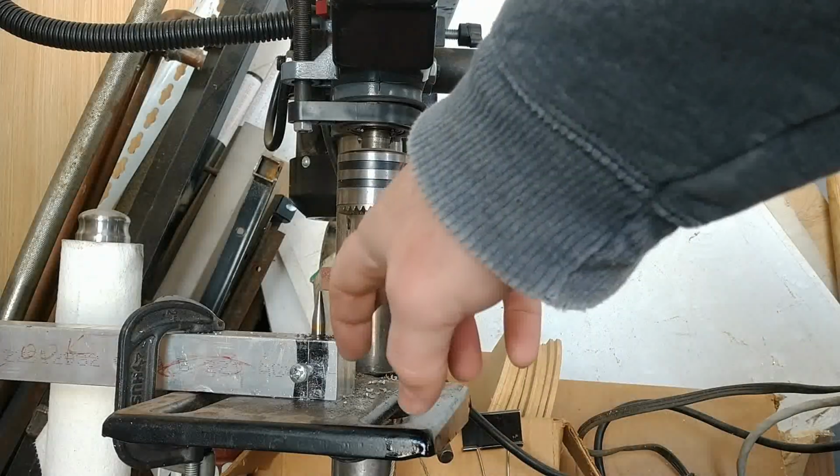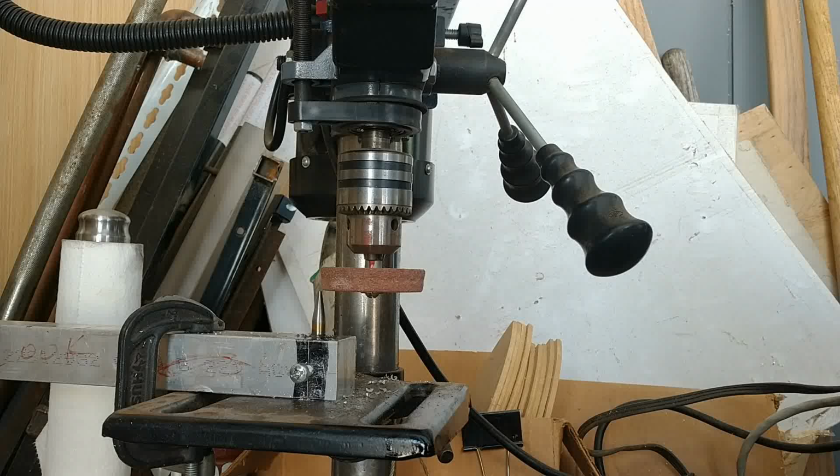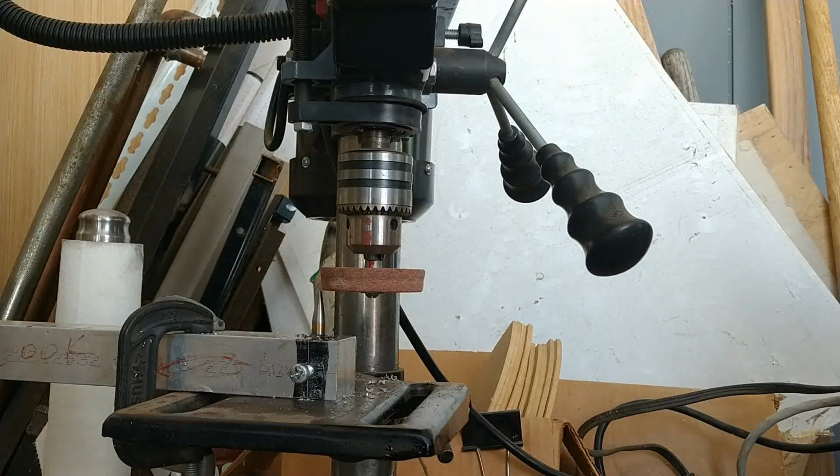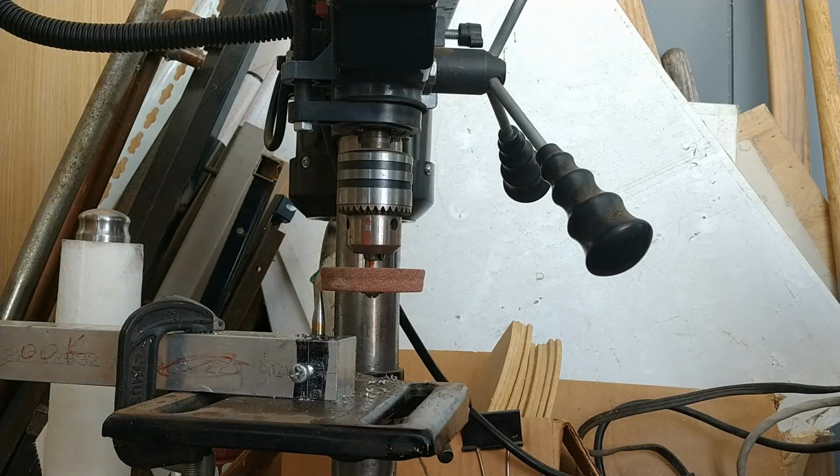I would also note that the grinding I put on the left side of the cutter with normal rotation would throw the sparks away from me, and the cutting edge that I'm producing is the edge that is directly in my line of sight. So I sort of set it up to succeed and see the results I'm getting as I go.